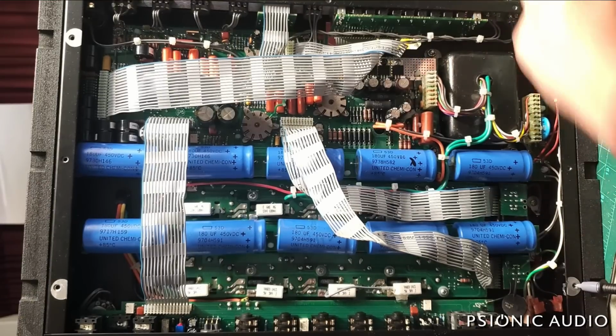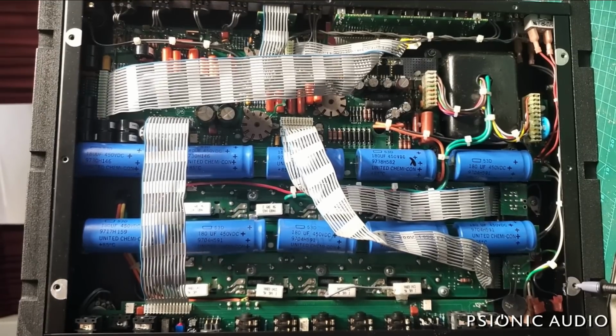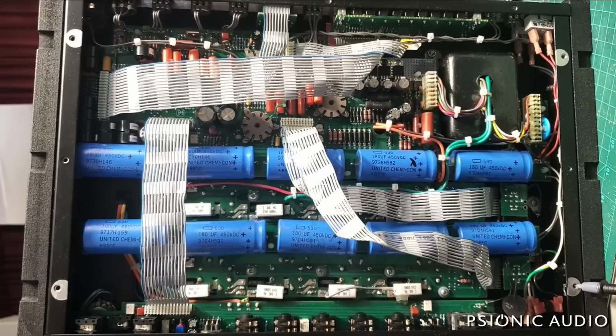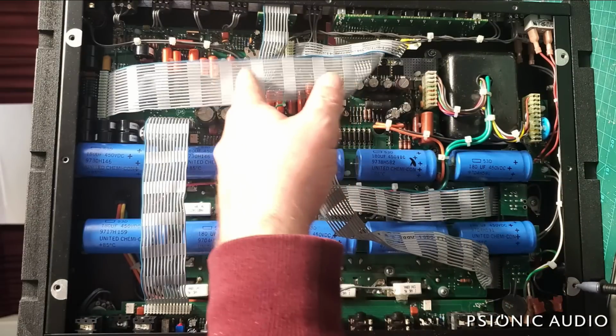Let me power it off first before I play around with resistors, because the node feeding that is supposed to be at 428 volts. While I've got all of your attention here, that is node C, which I believe is a node on the Prodigy which is affected by a service update. Let's see here. Yeah, R106 in the Prodigy was a 10K half watt, which they updated in later revisions to a 10K 3 watt.